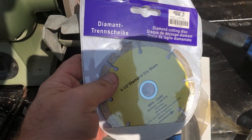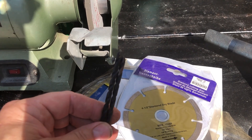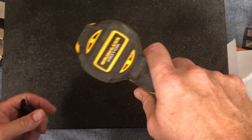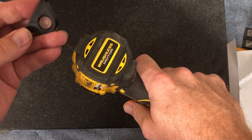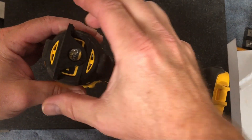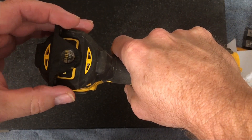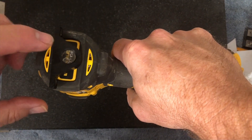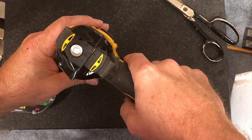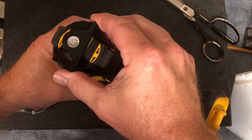Try to avoid serrated blades because they make an interrupted cut and it's just harder to hold, especially when the bits are small. I'm going to cheat a little bit because we're drilling by hand — your drill generally goes like this or you're drilling in at an angle. I'm going to put one of these levels here with a white piece of paper under it so I can see it, then tape it onto the back of my drill. I'm lucky because the drill has a flat spot on the back, so this will help me stay perpendicular to the hole.